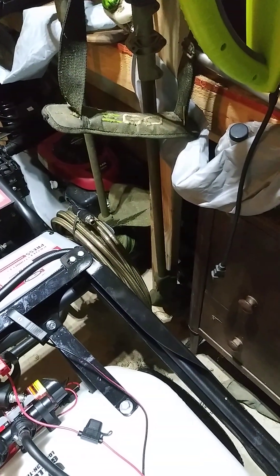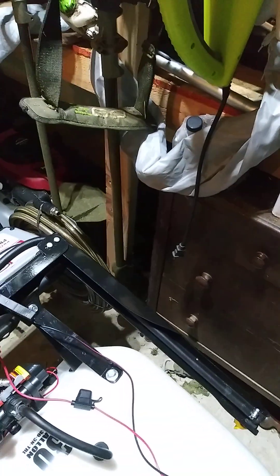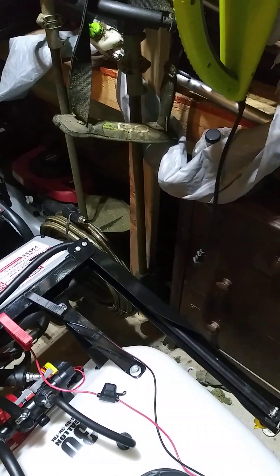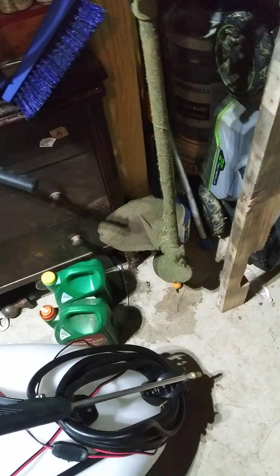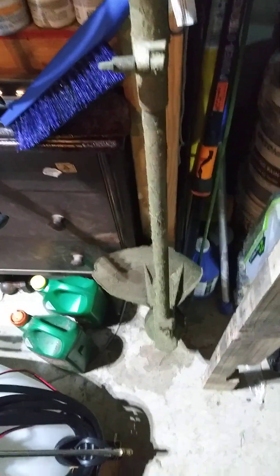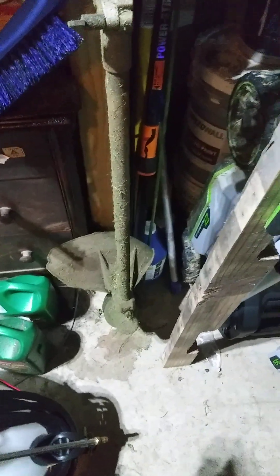You can also add a shoulder harness strap to these things — useful if you're hanging the trimmers in a trailer. I did take the guard off of one of mine — it helps if you're going through natural streamlines or ditch lines and you're not worried about throwing rocks. It also takes about two to three pounds of weight off your trimmer, which makes it easier to carry. When you're doing that eight to ten hours a day like commercial guys are, it will get to you after a while.